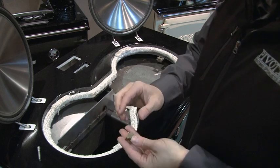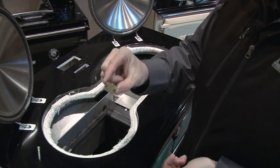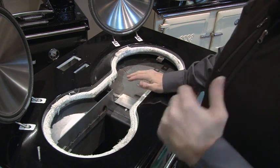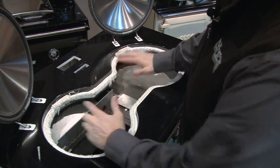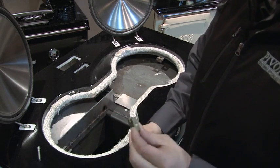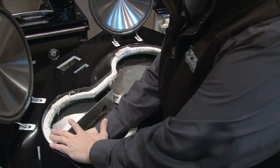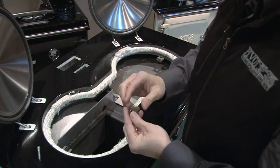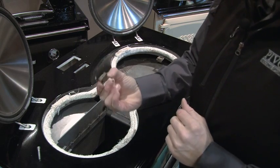And the benefit for that is what ESSE have invented, these little H supporting brackets. During that transport with all the boat trips and the car trips and the truck trips, that hot plate did not move and did not chip because it's fixed by these. So these are transport locking nuts designed to lock the hot plate down during transport so it doesn't move in transport. Now ESSE may disagree with me with this, but I do know these are not required after the fact.